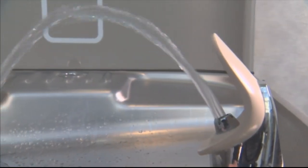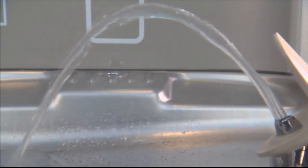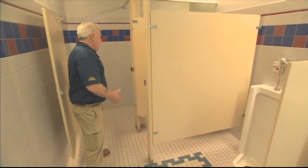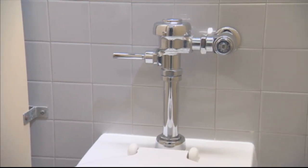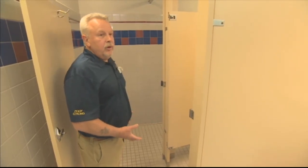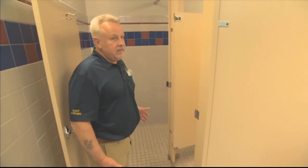We're right next to a women's and men's bathroom. Why don't we go inside, because there's lots of plumbing in there. So in here, Stu, this basic commercial bathroom, we have the toilets and the stalls here. Now, these are flush valve type toilets. So you're not just going to come up and flush these things after a month or so of non-use, because you could release some airborne pathogens that are going to be highly toxic, and it's going to be a very dangerous situation.